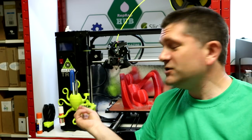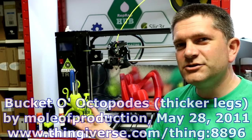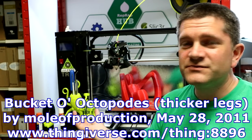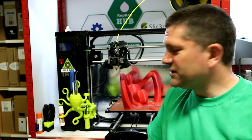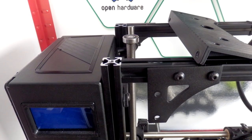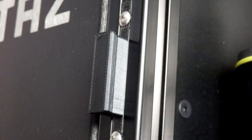I wanted to keep it really simple, so I used the original octopus model, which has a slightly lower-poly, lower-resolution look than more modern octopus designs. This makes it a little easier to modify in CAD tools to allow fitting of tools. I also wanted to put a hidden clip on the back — you slide a 3D printed section into the T-slot up top, undo a few bolts, and then lock and clip the Octo tool holder into the position you want.